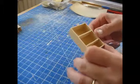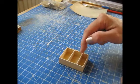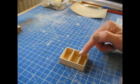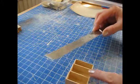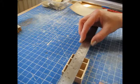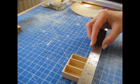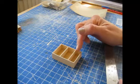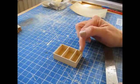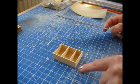Don't cut the drawer pieces until after construction in case the shelf was placed slightly higher or lower, which would make the drawer the wrong size. The depth and width stay the same — it's just the height you want to double-check. Measure that opening; it should be 13mm, so the drawer would be 12.5mm high. Always deduct half a millimetre so the drawer opens and closes easily. Adjust the height measurement accordingly on the side pieces and back piece.